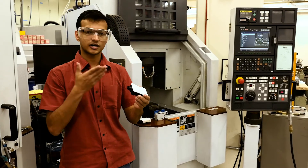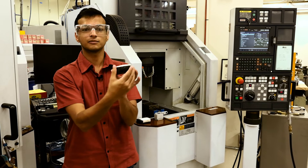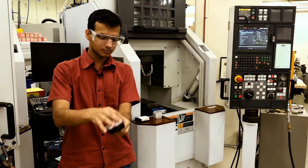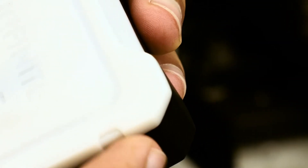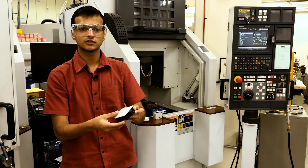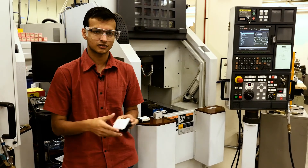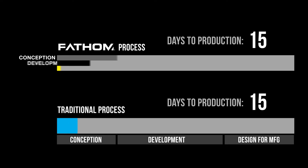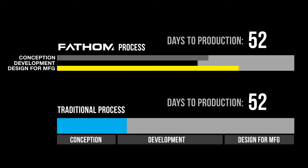Using 3D printers, we prototyped all these different parts. We didn't prototype the whole product just to test one functionality. We prototyped small pieces — let's say just the corner of this — to simulate what that fitting is going to look like, how that gluing is going to work. Different parts of this product were prototyped differently on different machines, so we don't spend too much material but we get really quick results. Within a day, we were already on to revision number three, based on what we learned from the previous day.